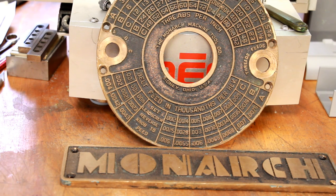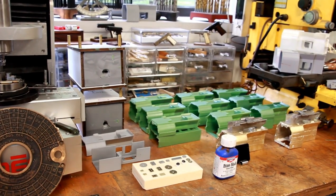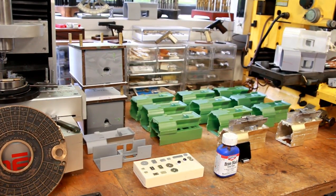Since I had all the plates off my machine that I bought as a model, I was able to photograph them. Using a program called MOI - Moment of Inspiration - I was able to draw and scale them down to the size I wanted, then I generated toolpaths for machining them in another piece of software. All of these plates were cast bronze. In this particular era of the Monarch 10EE, I think my machine was a 1943 version, what they refer to as a round dial.